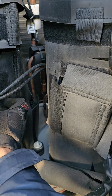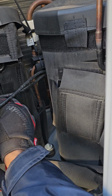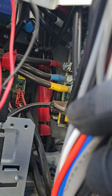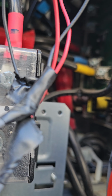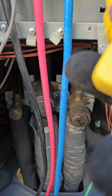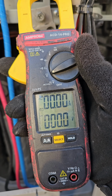And so I'm gonna go ahead and power this thing back up and connect the service tool back to it and fire it up. So I'm going to look for the amperage draw next. I could see it in the service tool, in the tablet, but I'd like to get my meter in there somewhere. My clamp on. These are the compressor wires right here. So right, if I could get it in here, clamped onto one of these. Okay, well my meter is dual, so I just clamped it. I ain't gonna worry about selecting anything.